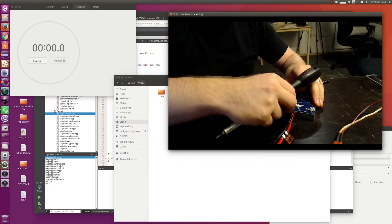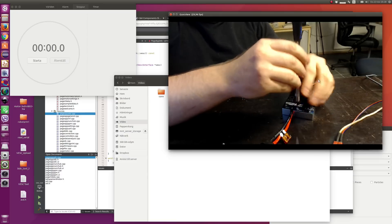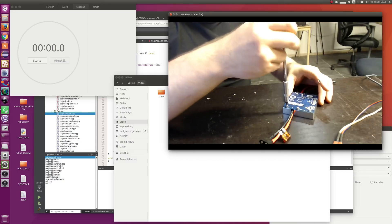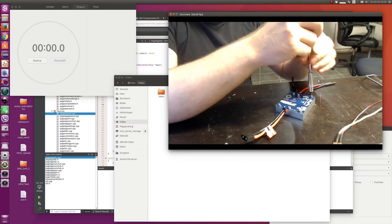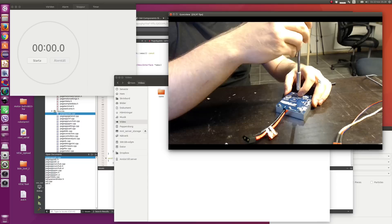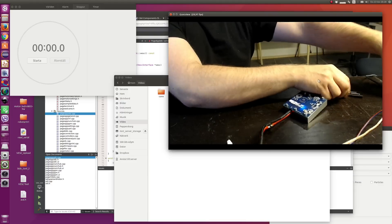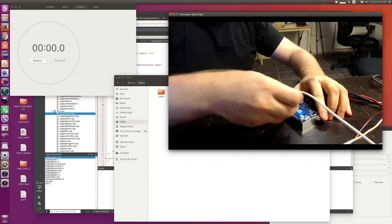I'm going to show a demo where I'm connecting a motor and running it in a new mode which I've made to experiment with AC induction motors. It can output a constant voltage vector that rotates slowly using sine waves in open loop, which in this case I will use to just run some current in the motor without turning it really fast, and dissipate a lot of power.